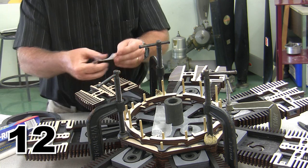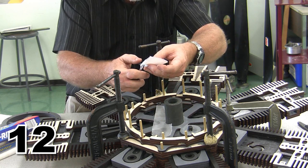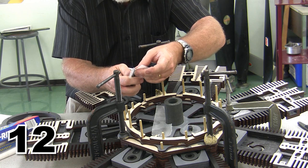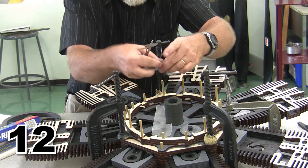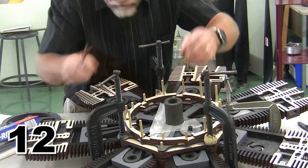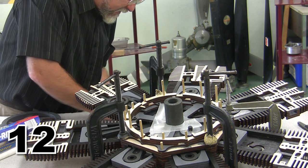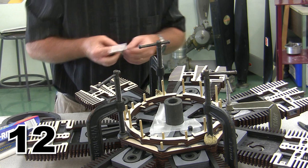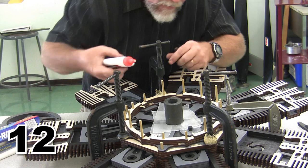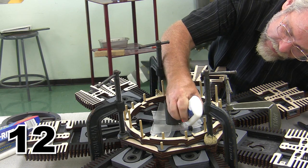So we're going to take that wax paper, I'm going to make a couple more of them. This time I'm actually going to just press it down on that shaft so I can see the exact right curve. And I'm going to leave just a tiny little flange on my wax paper. And I'm going to put about 3 to 4 of these little sheets of wax paper around here to try and help me not make a mess of putting this gear. I'm going to get down here and I'm going to put just a few dots of glue right onto the edge